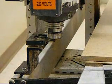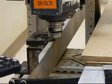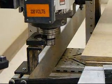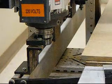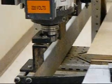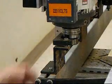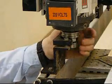It's best to get closer to the tool holder. And so once you get closer to the tool location, you want to flip or click into step mode. Once you're in step mode, you can jog more slowly. By getting closer, you can get a more accurate view of where your machine is or where the tool holder is.